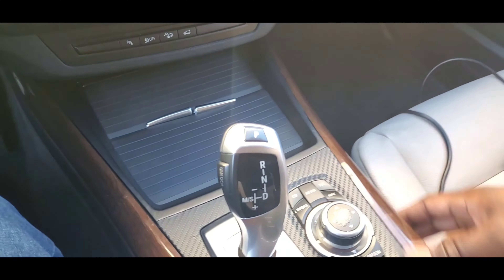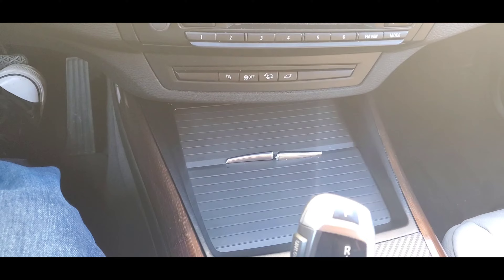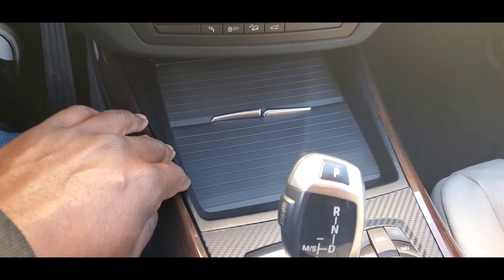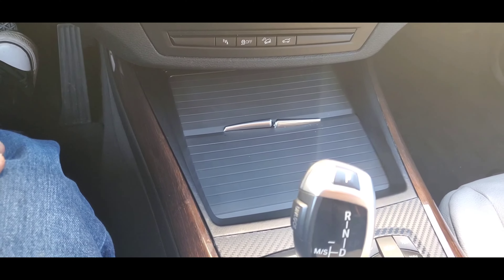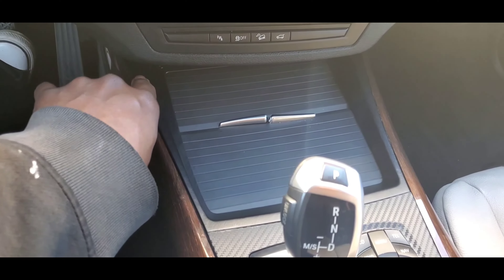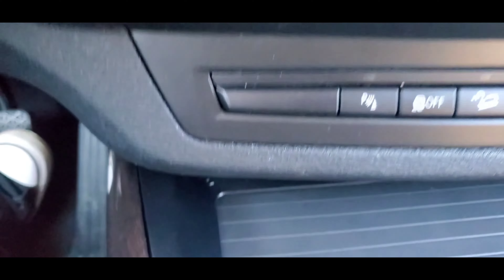I know it was kind of shaky and hard to see, but I did get everything in. I did repaint this — I sanded all of that rubber coating off of it, then I did it with a 120 and then went up to like a 400 and then an 800 to get all the scratches off, and then I just sprayed it with a vinyl flat black spray. I suggest letting this dry for like a day or two. The part that slides in up here is always gonna get scratched, but you can't see it — if you look up under here you can't see it because it's all the way up under there.